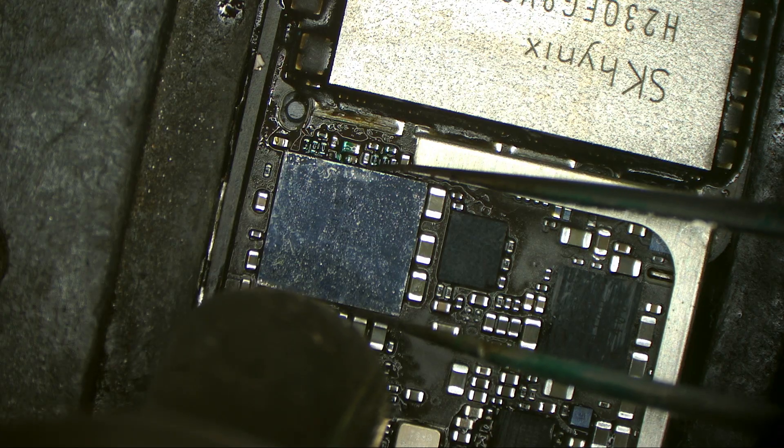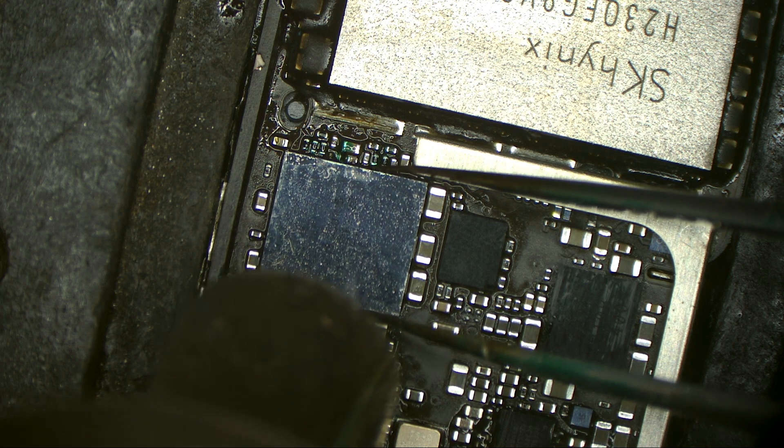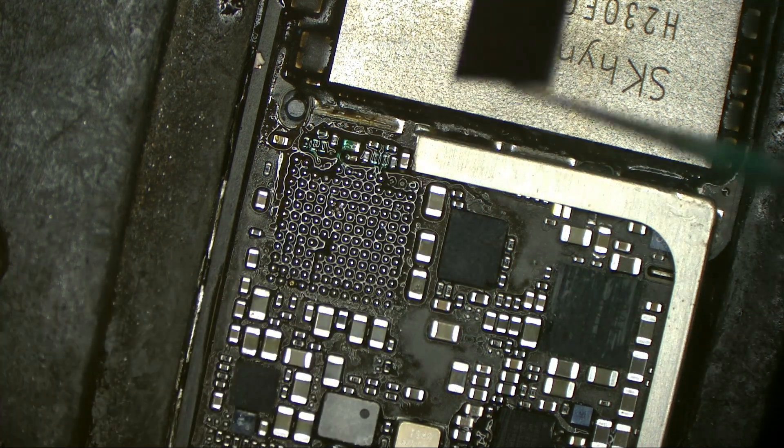For me this is not the end. Obviously I could give the phone back to the shop and charge for the repair, but maybe the problem will come again after a few weeks or a month or two. So I prefer to change this chip and make sure that the connection under the chip is done right, because this doesn't seem like it was done properly.